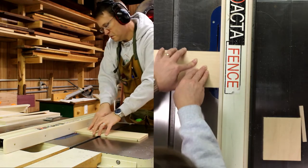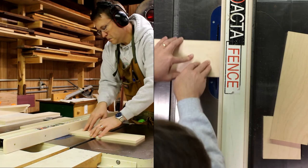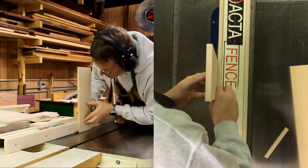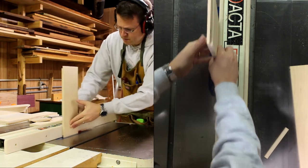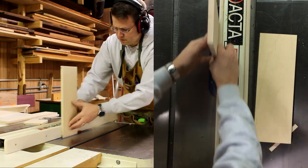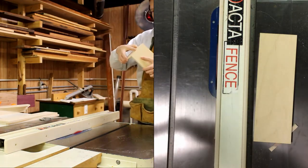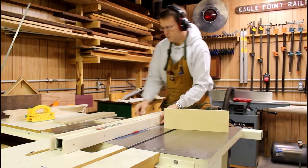You could do this with a regular butt joint, but I like making the rabbet joint because it has extra space for glue and makes the box a lot stronger. You can see I'm cutting the depth first, then sliding them vertically through the saw to cut that little piece out. You may notice a small offcut flying back at me as I'm cutting these — this is the third one. Flip it over to do the other side and now they're ready to put together. I'm checking the joint to make sure it fits well.